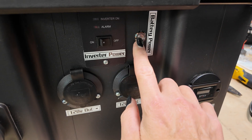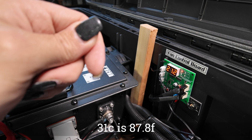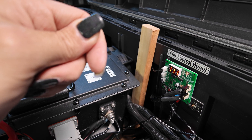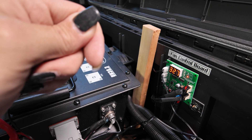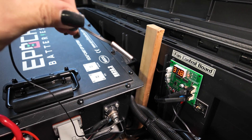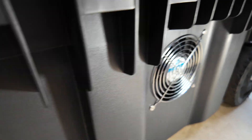The temperature on the control board is reported in Celsius, not Fahrenheit, so these numbers probably won't be that familiar if you haven't done a lot of traveling to Europe. I put it in the palm of my hand to watch it warm up and watch the fan actually increase in speed as I hit 30, 31, 32 degrees. It worked perfectly, and then when I let my hand off the probe the temperature went back down and the fan started blowing slower, which is exactly what I wanted.